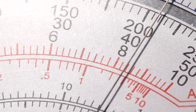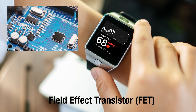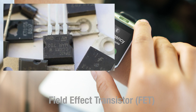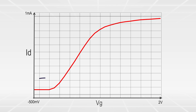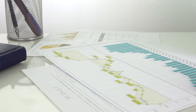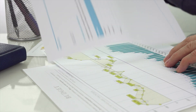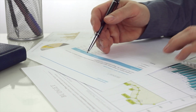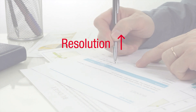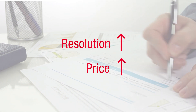Hi, I'm Anna. I am developing FETs for IoT devices. These FETs must have low leakage currents so that batteries driving them can last longer. The leakage currents are in the order of femto to pico amperes in the off state, and we need to measure these leakage currents accurately using an SMU.